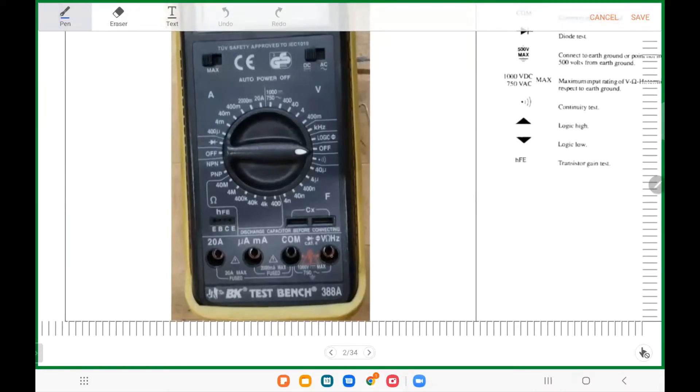To the right here, you will see the terminals used to measure voltage and ohms. It also shows hertz frequency but we don't care about that right now. When you want to measure voltage or ohms, you connect a wire here, and the second one is the COM terminal — that's like the ground connection.